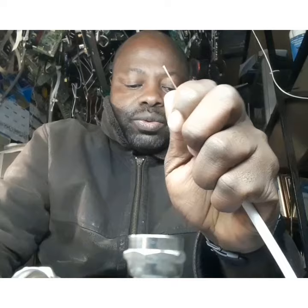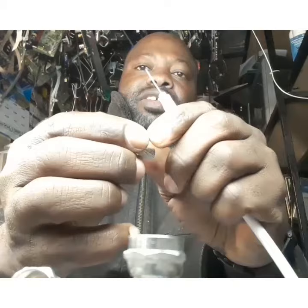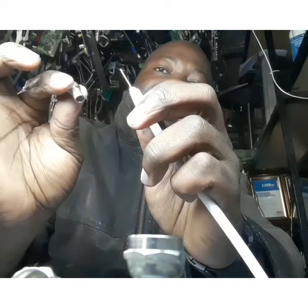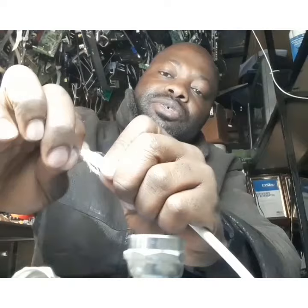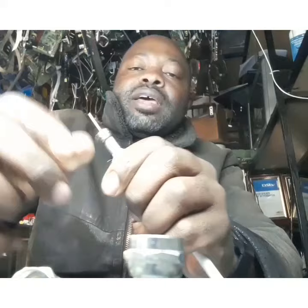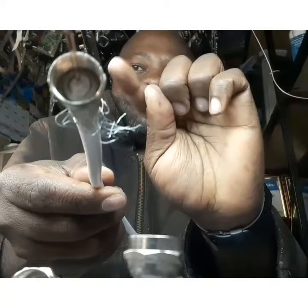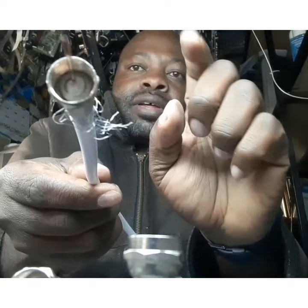And then I'm going to use my F connector now. This is the time my F connector has to go on. Check inside, you're going to see there's a hole inside. I'm going to push my F connector so that this part stays in the F on the negative side. I screw it inside like this, till you can see nicely the way it is inside. The positive must not touch the F. You can see the positive is in the middle, so it's not touching the F, okay?